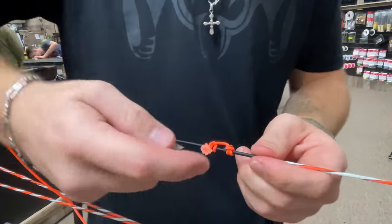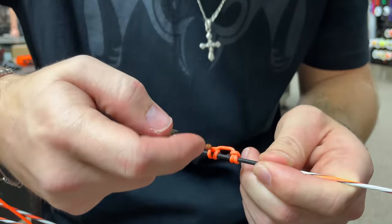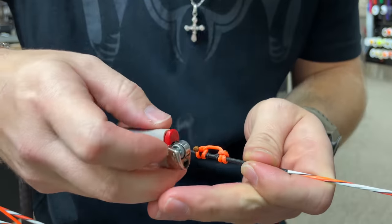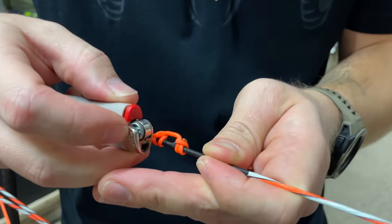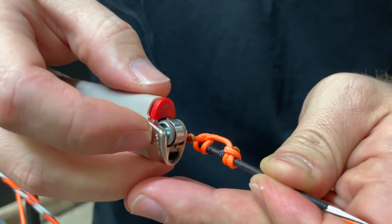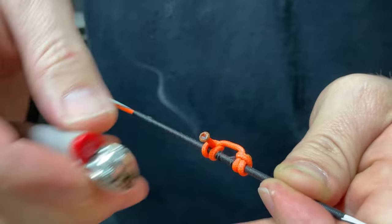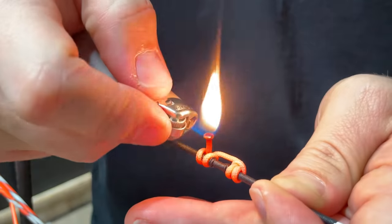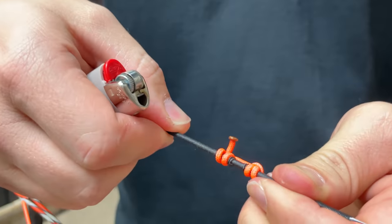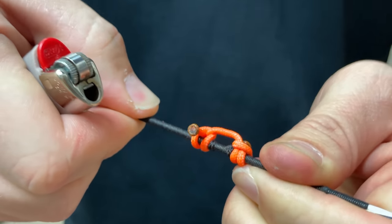The bigger you open it up, the bigger the nail head's going to be. You're not trying to really completely catch it on fire. I'm just trying to get it right to that point and then slowly smash it down. If you push it really hard, really fast, you don't get the shoulder on that nail and it makes it really, really thin. That looks perfect. So if you're patient with it and get it just right, you'll get a perfect uniform nail head all the way around. Look at that. On both top and bottom.